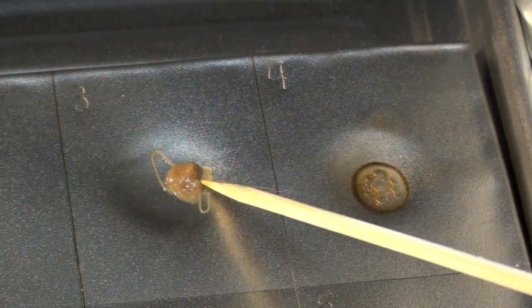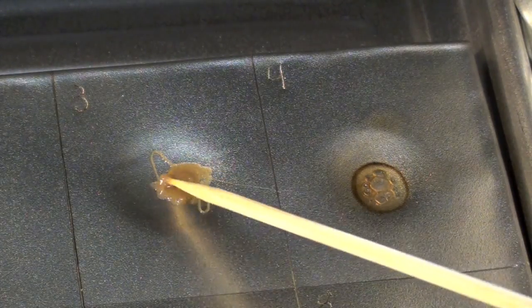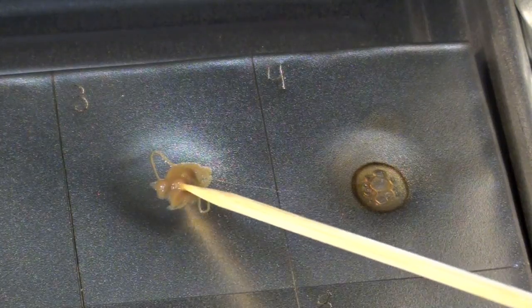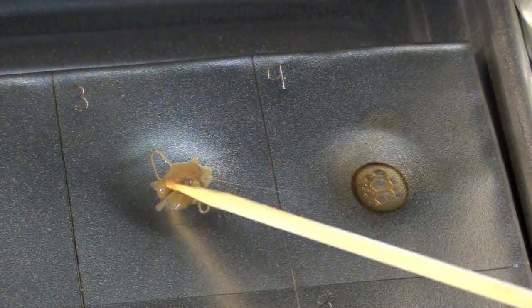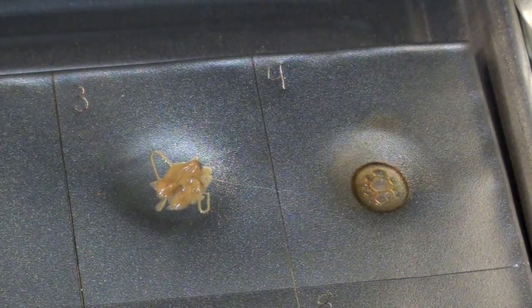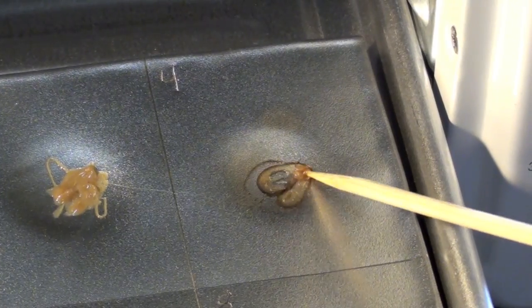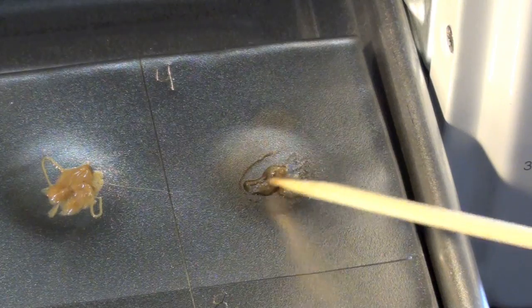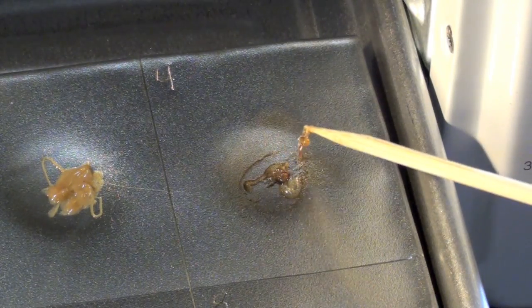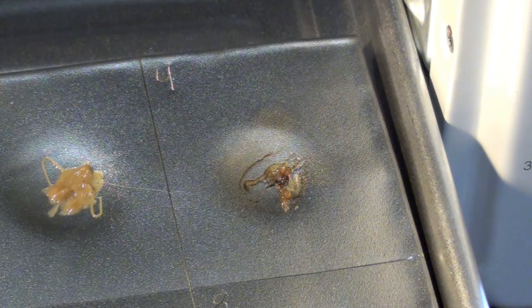And this is that Pro Lube, Pro Gold. Now the Pro Gold probably has maintained closest to its original consistency. Interesting. And an oil here, you could. Oh, that's weird. This is Ballistol. It's gummed up. And we're talking 300 degrees. Wow. I thought these would hold up better.